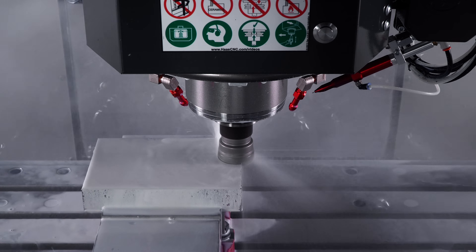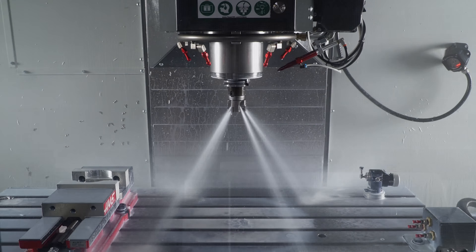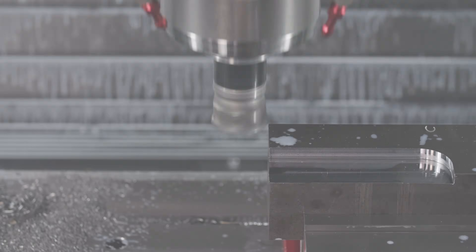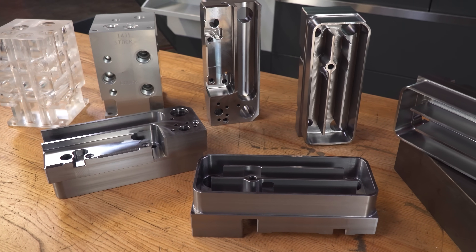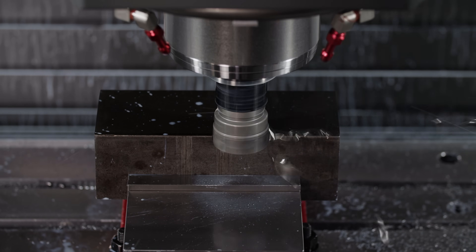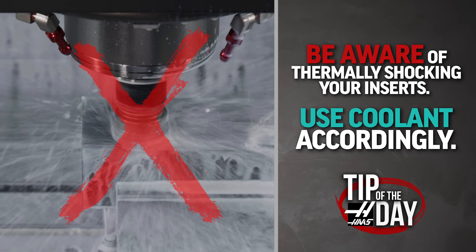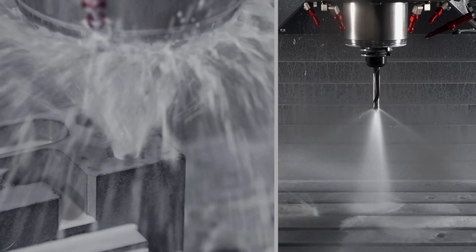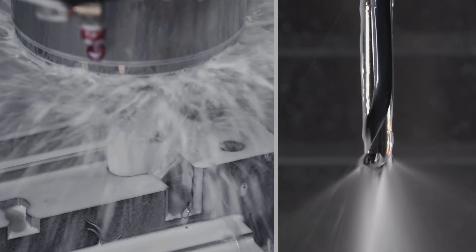When milling on aluminum, we can run so fast and hard that we risk our chips sticking to our tool if we go even a few moments without coolant. TSC right on our inserts allows us to run our tools much faster on aluminum than with flood coolant alone. On steels, with the right tools and coatings, we don't always need coolant, but running coolant will give us better surface finishes, so our finishing passes almost always prefer running with coolant. But it would be a big mistake to run dry for our roughing operation, heat up our tool, and then turn on our coolant for our finishing passes — this big change in temperature can thermally shock our inserts and might cause them to crack. If we are going to run coolant on these tools, we need to be consistent, and that's where TSC comes in. TSC gives our tools a steady, high volume, high pressure flow of coolant for consistent temperatures and results.